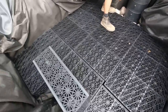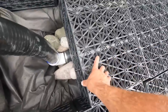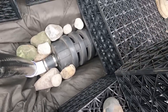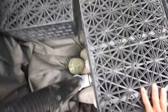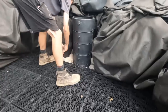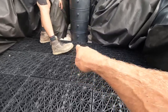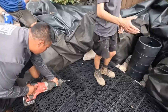Here's that setup. We've got our snorkel down there, and then there's our centipede that runs out underneath our aqua blocks. We've got a couple small cobbles in here just to fill that void space and prevent these things from rocking back and forth. It's very important that you dig the trough for the centipede at the correct depth so that these small aqua blocks fit right down on top and aren't moving around. Jack is filling with cobbles around the snorkel to keep it nice and vertical. We do pitch our centipede slightly backwards so that all the water, when we do a clean out, drains down to the bottom of that snorkel, making the clean out very easy.